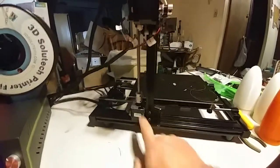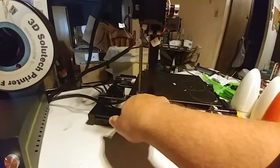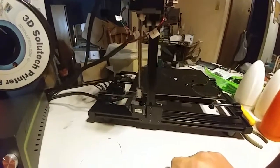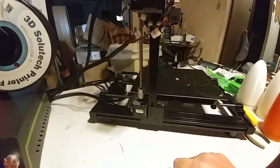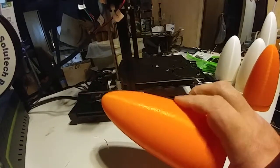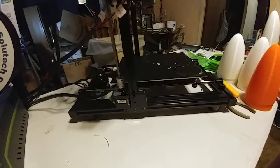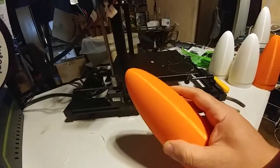What I did was simply undo these two screws and then physically grabbed the motor and turned it. That proved to be a very bad idea because now I have a pretty pronounced z-wobble on my prints. It's pretty hard to see on camera because it's minor, but it's very visible in person. I have since partially corrected it and I'll explain how.